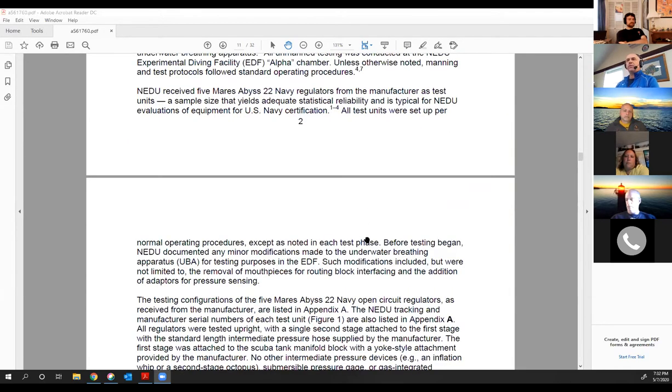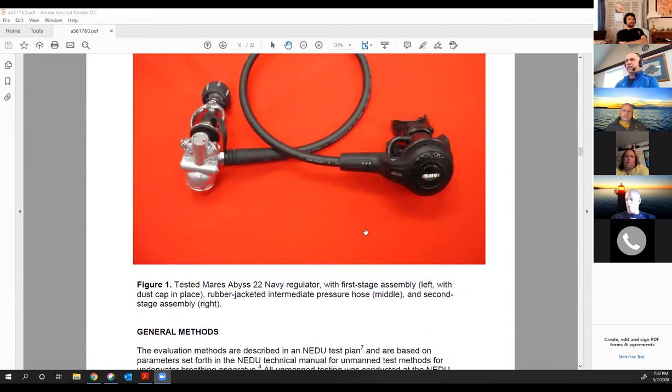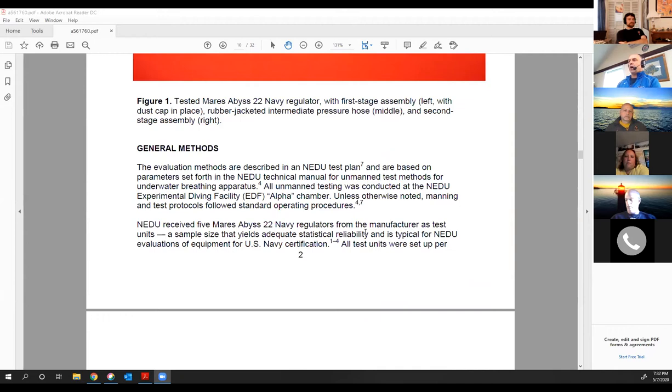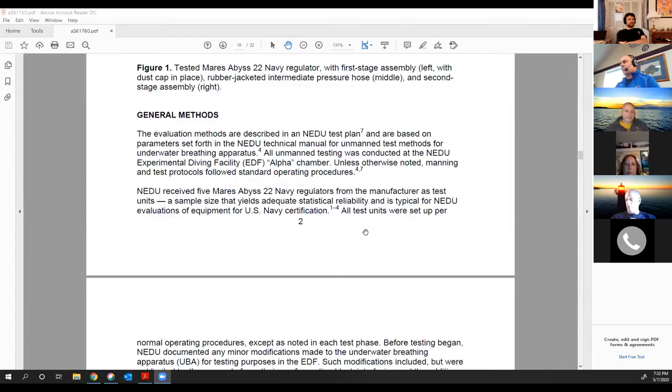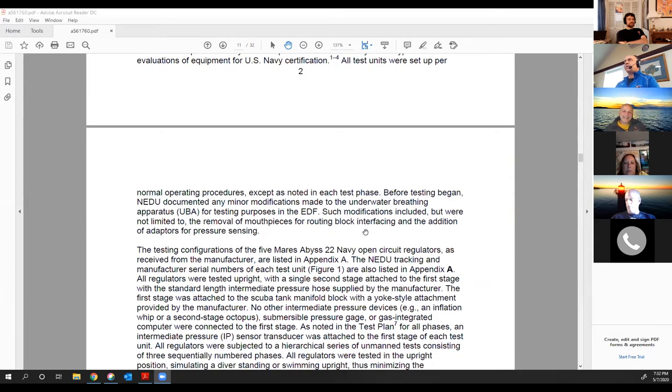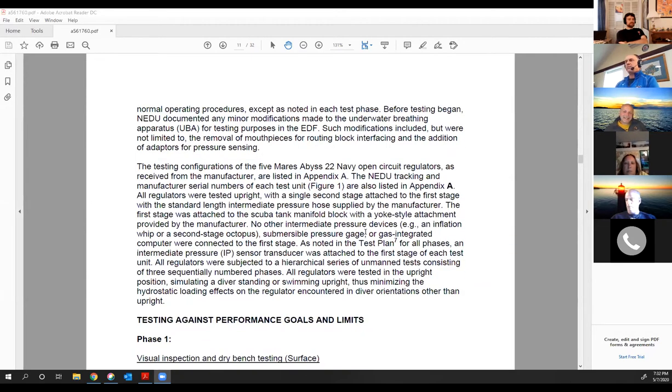The reason I think, Bill, that you are interested in a cold water regulator is that you had a perfectly fine regulator that served you fine up to the point where you went diving in Tobermory. Tobermory, right. Right. And the regulator did what a regulator does when it gets really cold, is it free flowed. It gave Bill air. It also, I say, Bill handled a free-flowing regulator at depth in cold water extremely well.